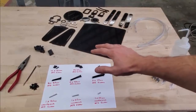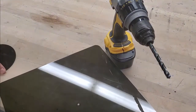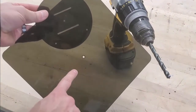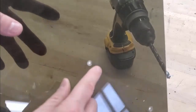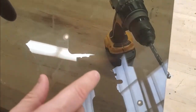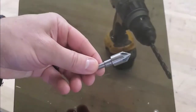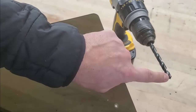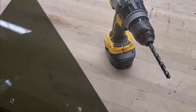Once you have all the required materials, we can start constructing the hydraulic claw. We're going to start from the base and work our way up. Obtain the platform foundation and the rotating base. Use your drill to create two countersink holes — one at the center hole and one at the corner hole. A countersink bit is ideal, but the tip of a traditional drill bit should work fine.